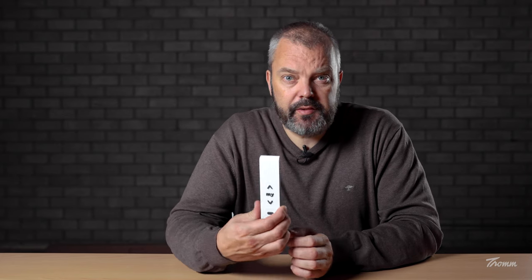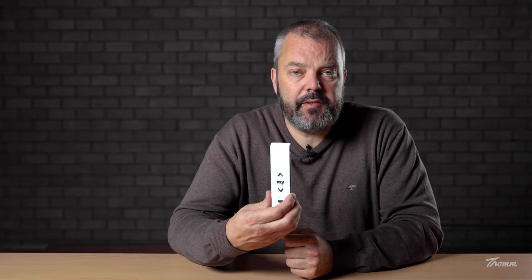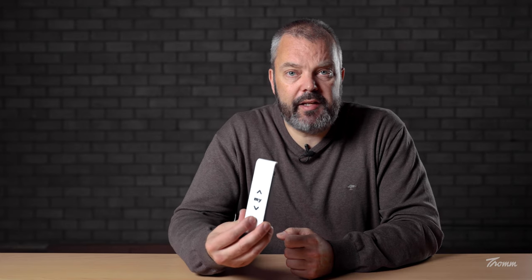You have 5 channels on this remote, so you can control 5 groups or individual motors. You can choose yourself which channel is a group channel or which one is an individual channel. You actually see only 4 LEDs — the 5th channel is the 4 LEDs flashing at the same time. That's no different from the other channels; it's just a channel you can assign a group or a single motor to. Just remember it's not automatically a group channel, so if you want to make a group channel, you have to do it manually yourself.